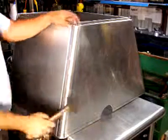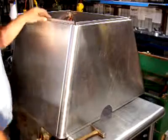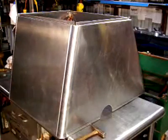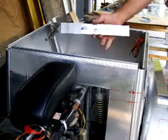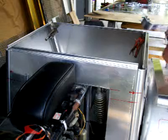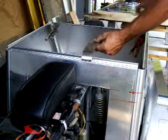After clamping your 4 sides, tap all the corners level and keep it square when tacking it together. Then get all dimensions for your floor. In this step we're going to figure the size of our lid. Take a 12-inch strip of metal, do test bends. You end up with 9 3/8. Set that on the box.